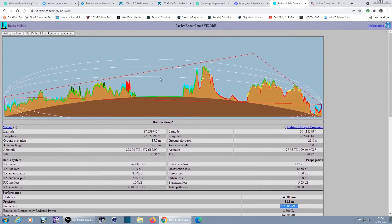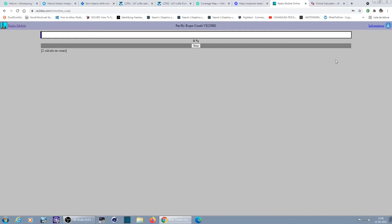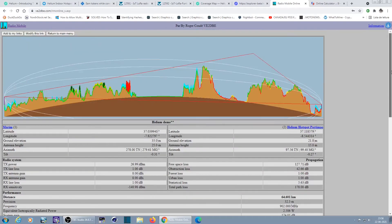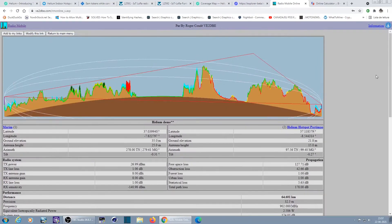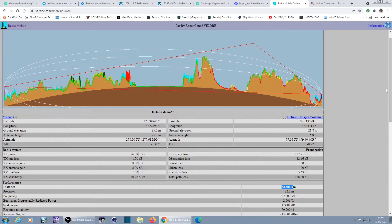This frequency is used for Internet of Things — many devices use it, and phone operators are using it too. Now let's pretend the other fellow on the other side also adds an 8 dBi antenna. The signal improves and we are perfectly in conditions of communicating. There are other factors such as interference — we're both located in cities and the link crosses some cities — but in theory it could communicate 64 kilometers away, which is quite impressive.